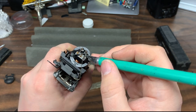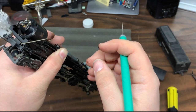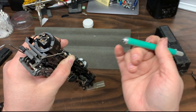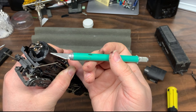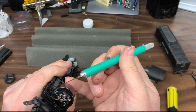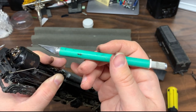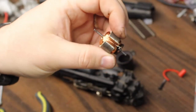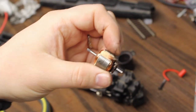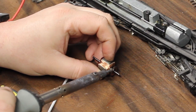As I said, I did work on this earlier and took some other video. One of the things that happened is once it started to run, it would kind of jerk. It turns out I ended up taking the motor apart because eventually it just stopped working altogether. One of the wires — off the turns of magnet wire in the motor — had actually come loose from the commutator. So I had to solder that back in place.